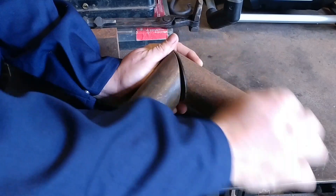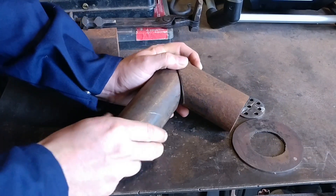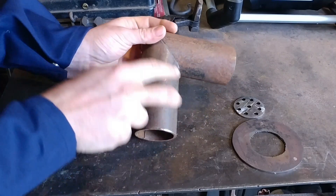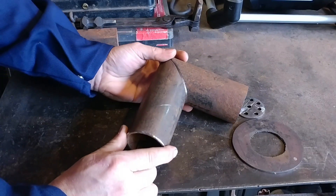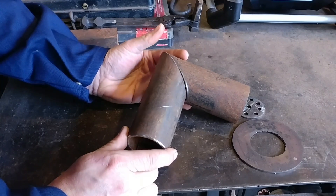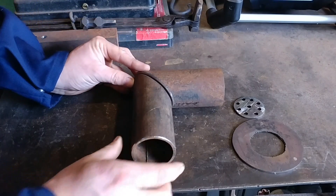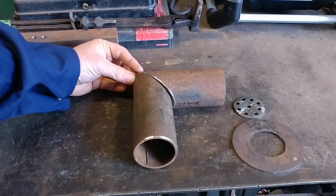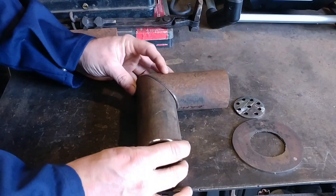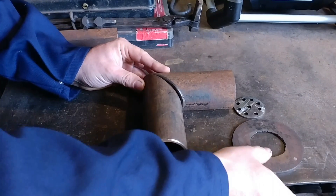You don't want to just sweep it through and get velocity out the end of the burner, because you're not mixing the fuel and air well enough together to create an efficient burner. My design is built upon efficiency and building a really hot burner. This is just done in industry for a great many years and for a great number of reasons.